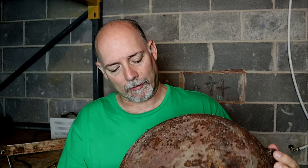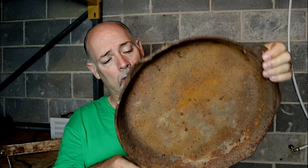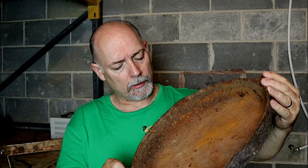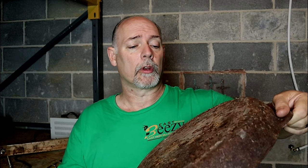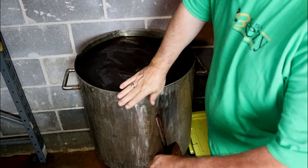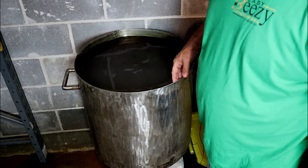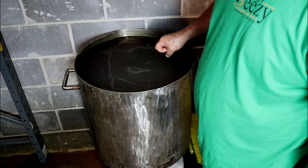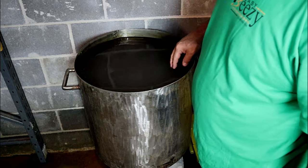I'm out here in my shop and I've got this number 14 Century Series skillet. It's really rusty and a little bit gunky. I'm sure this one's going to come out a little bit pitted, but I figured this would be a good one to try since it's a big piece. We'll give it a good washing and stick it in our electrolysis tank and see how it does. I have a stainless steel electrolysis tank. You can use a plastic tank with rebar as the sacrificial anode, but this stainless steel works great. It cleans really easily.